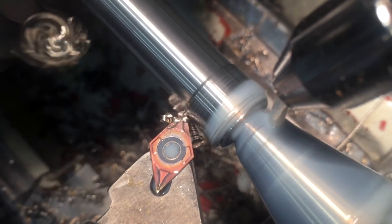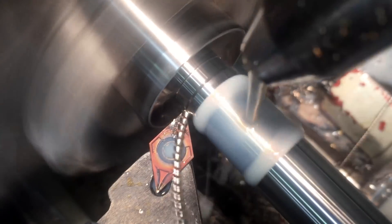So I'm cutting off the back side of the insert. This is for two reasons. The first reason is I want to cut into the center — I don't want to push it off center. The second reason is that I want the chips to have lots of space to leave the cutting area, so they don't get jammed in there and rub against the workpiece. You can imagine when I cut the other direction, there's a little bit less space for them to accumulate.